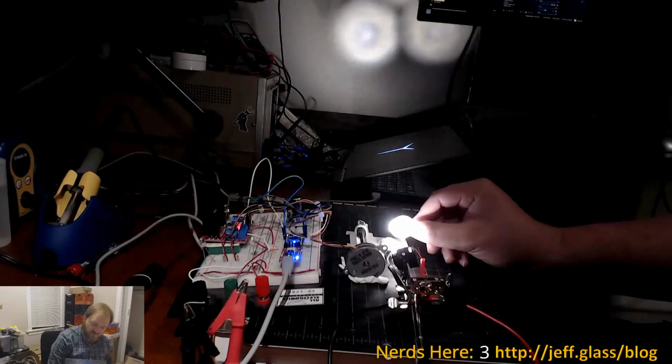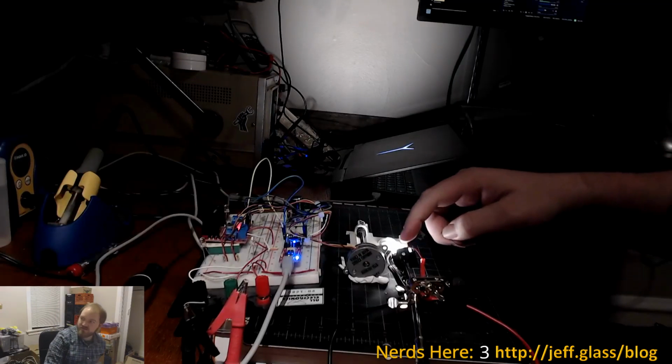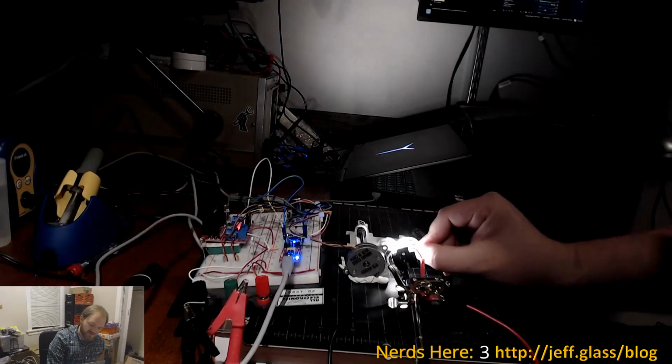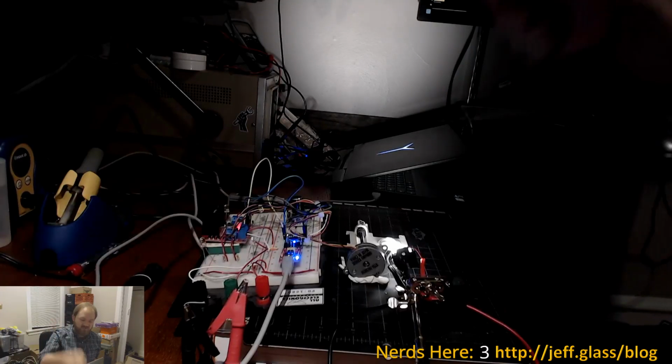Interesting. It's another factor in all of this, as long as we're making up how optics work: all of the emitters on this die are coplanar. They're all shooting perfectly parallel to each other, and this optic is also emitting in parallel, sort of coplanarly. It's not like they're converging on a point.